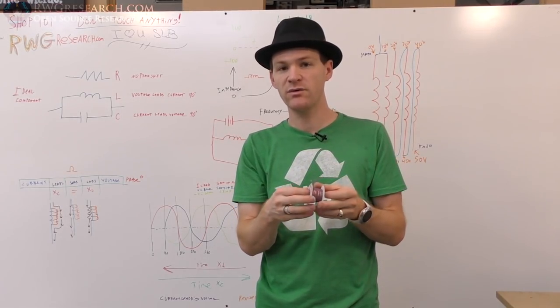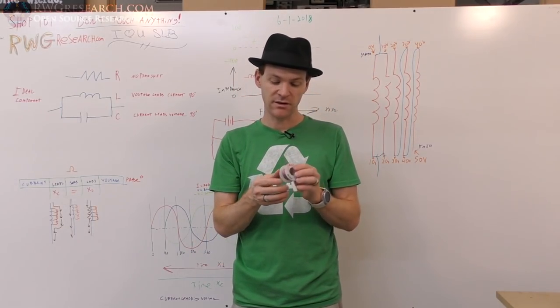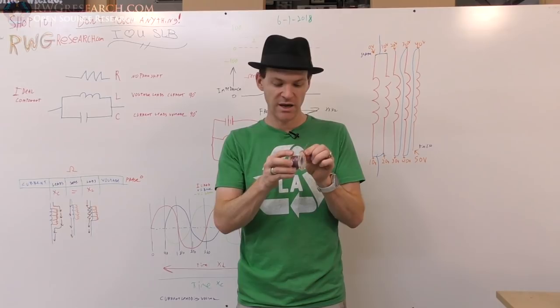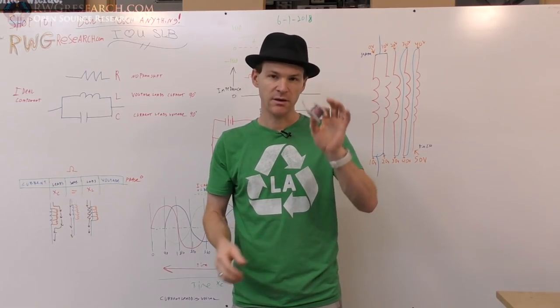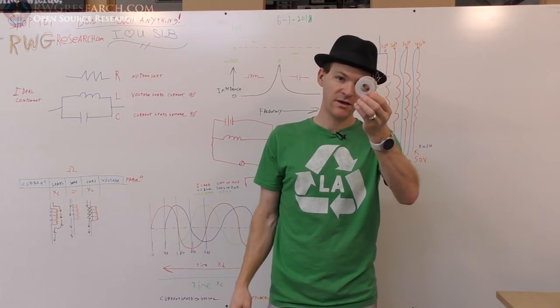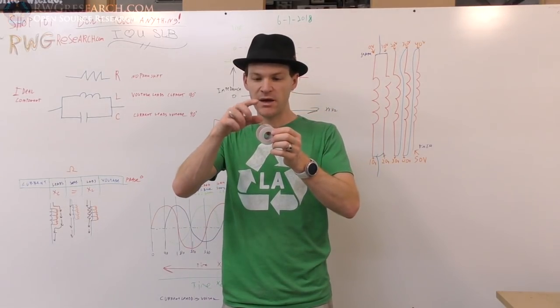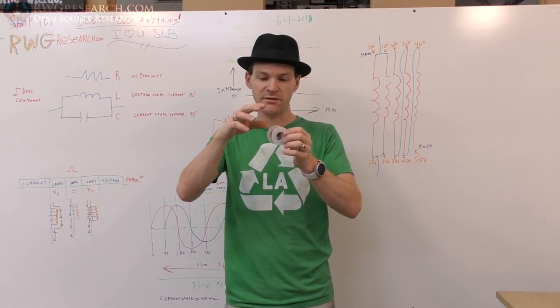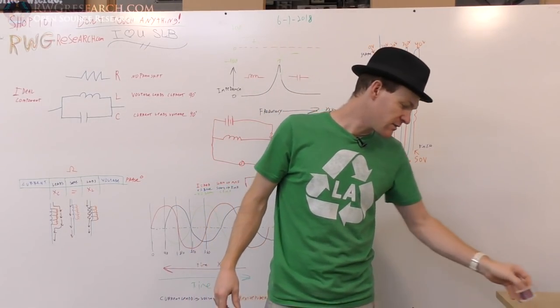But when you get into high frequency, you start talking about skin depth and the skin effect, and that is whenever those things start to change a little bit. But for the lower frequency stuff, it doesn't really matter. These are identical. So just a little reference piece there in case you were wondering. A bunch of wires in parallel, same diameter, same amount of copper mass, doesn't really change much at all, but the skin depth is affected in this case.